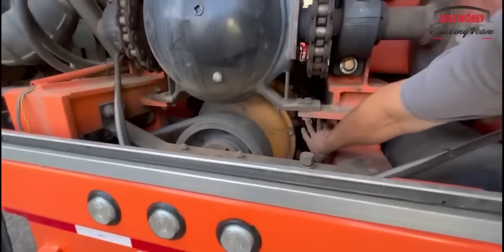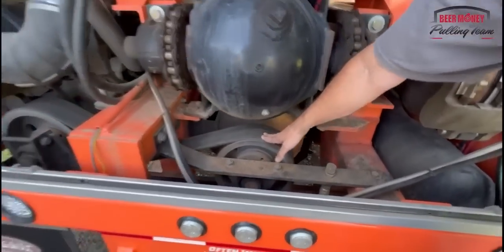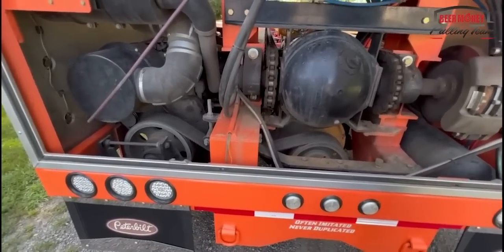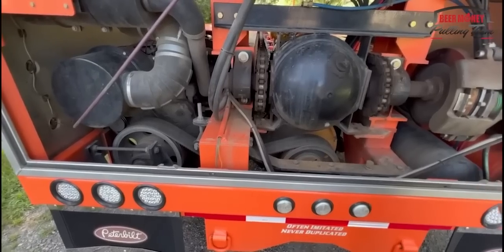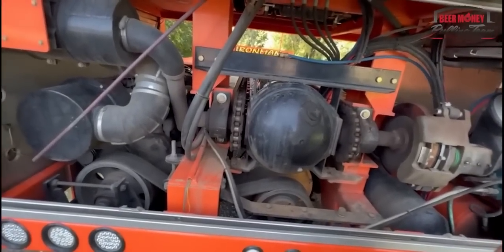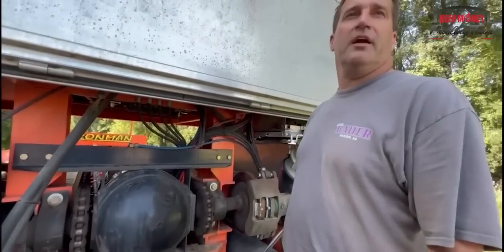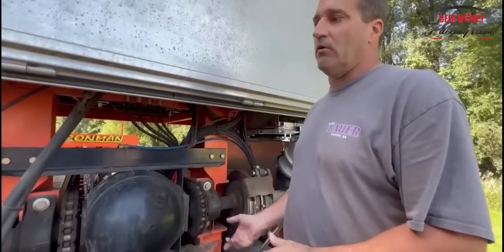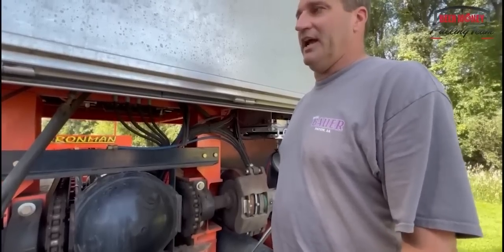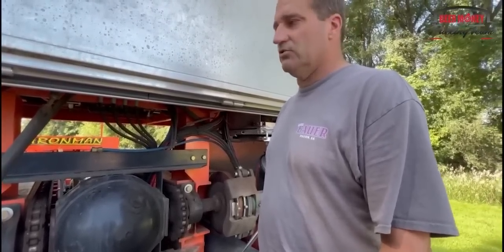Oh, is that an Allison? It is. Allison automatic transmission, and we belt drive that off the back of a Deutz free air, fan air, however you want to say it, just for the point of cooling. Right. And the awesome thing about using Deutz engines is they don't care if you pull power off the front or the back. They're not fussy. And a big advantage is not having to worry about coolant. Right. You know, that's a huge plus.